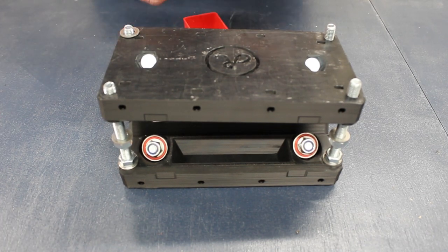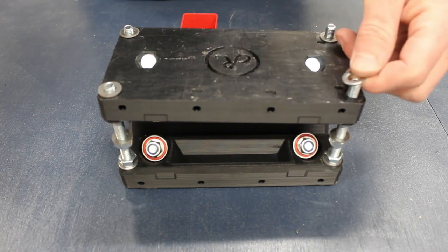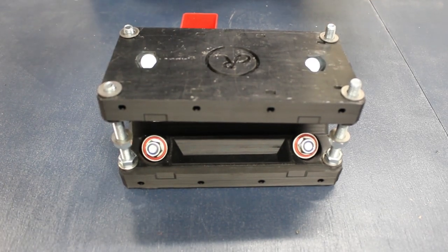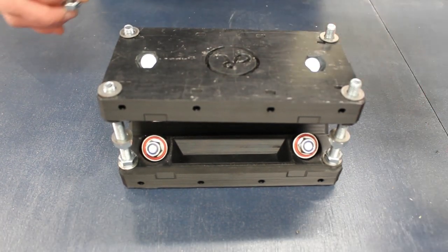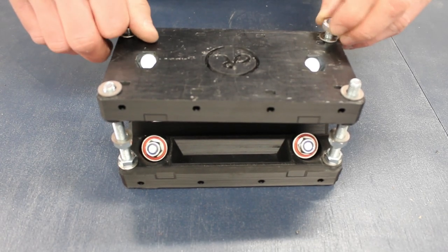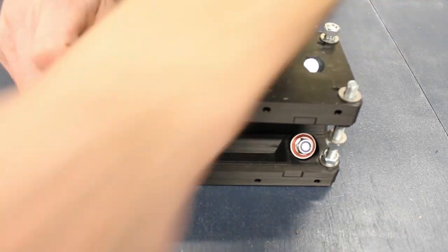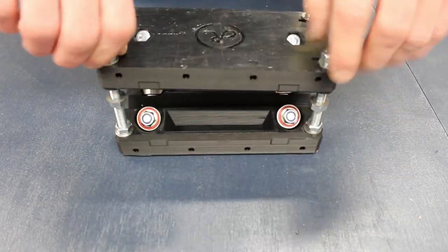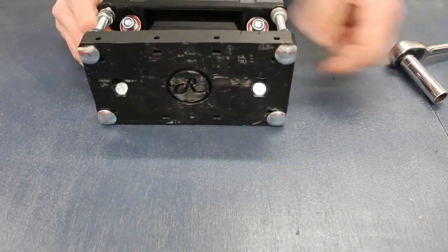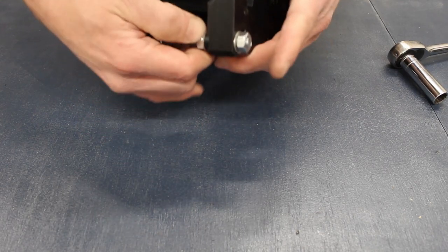Once you've got the carriage into place, it's time to place some additional M8 washers followed by some standard M8 nuts on each of the four corners of the part. It's not critical that you use lock nuts here, as we'll use the previously installed nuts on the threaded rod to tighten against, so this will reduce any chances of vibrations causing the part to come loose. The additional nuts on these bolts will allow for some fine calibration to preload the bearing onto the box section. You'll see me do this later on in the video.